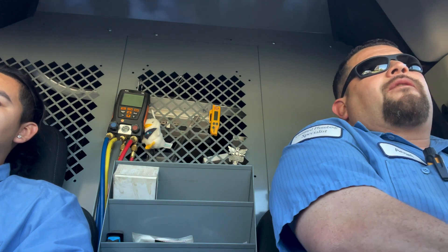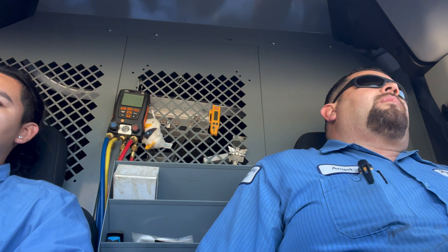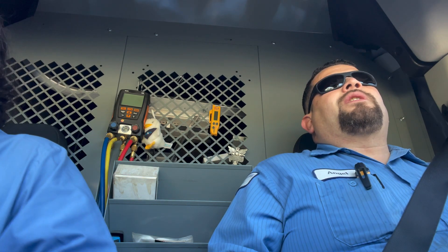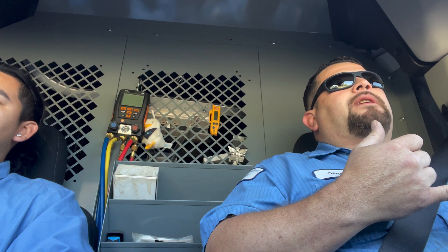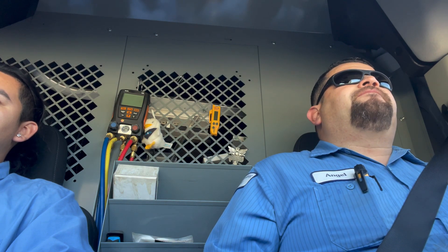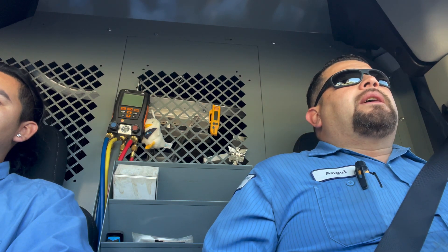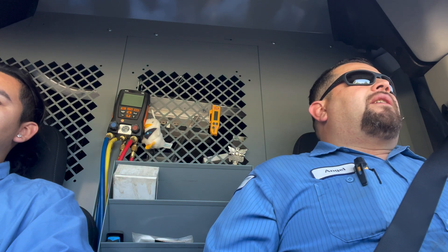We just got done with our first call this morning. This is George — I'm 10-7 here on normal. Customer was complaining he ran the heater and the blower kept running and wouldn't shut off, so he shut the breaker off. We found the filter a little dirty but not too bad, found a low cap on the blower, and cleaned the flame rod — on these Goodmans they have a real problem with a dirty flame rod. Checked the evaporator, it's clean and not restricted. We put a new cap, changed the air filter, ran the unit, did an amp draw on the blower — everything within range. Going to be 10-8, Yale.